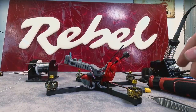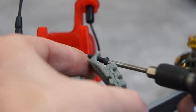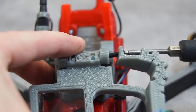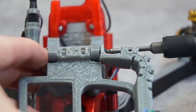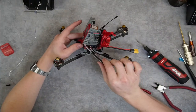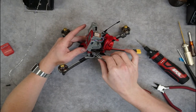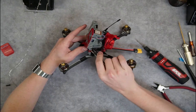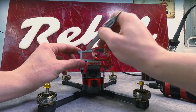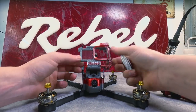Now that I've got that threaded through, I'm going to take a long M3 screw, poke it up through the cable track hole, being careful not to pinch any wires, and just bend that cable track over and in, locking it down. If you have a little bit of extra cable and you're worried about it getting in the prop, you can go ahead and poke that into the body of the quad. This is the Hero 9 faceplate with the GPS. You'll notice the Hero 9 faceplate has a shatter-resistant polycarbonate screen to protect the front lens of the Hero 9 camera.